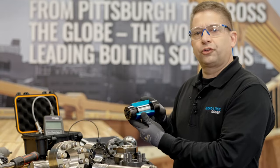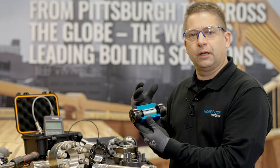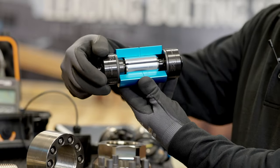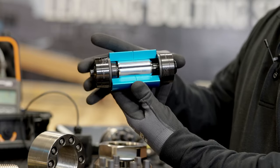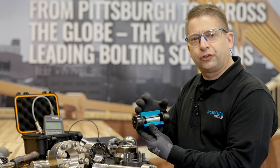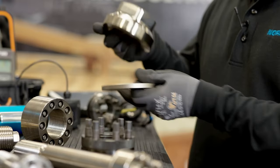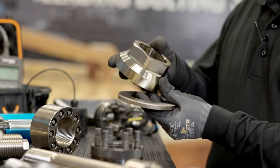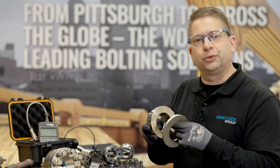Some of our other products are easy fit expansion bolts used in applications like rotating couplings. Mechanical tensioners are used to expand the sleeve for a fully fitted condition and for actual clamping. In removal, the sleeve contracts and allows for easy and quick removal. And here are flex nuts for the reactive side solutions. Flex nuts reduce stress concentrations and add elasticity to the bolted joint.